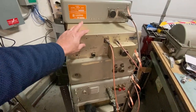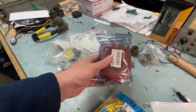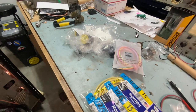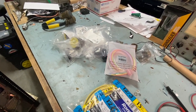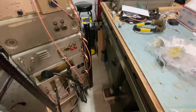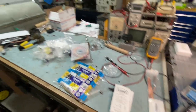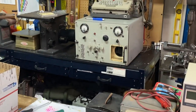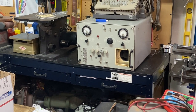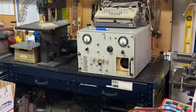Everything I need for the cable that goes between the power supply and the amplifier. I bought a power plug for the pre-selector, I have the wire — this is 20kV wire, I'll use that for the 2200-volt line — and then I bought just a 5-foot section of multicolor wire that's 600-volt rated for the rest. While I'm in the shack, I did add a couple more plugs. Now let's go over to the spare RF-110α that came with my haul and take a look on the inside. We'll take a look at the driver tubes, take a look at the finals, and look over some specs for those.